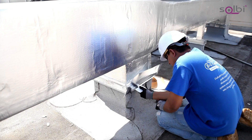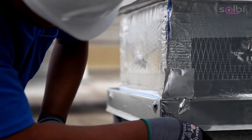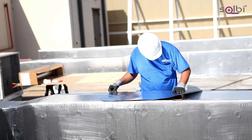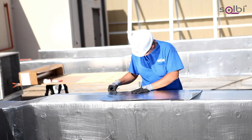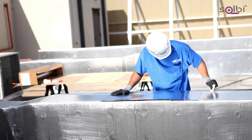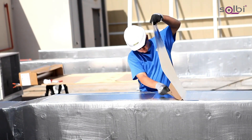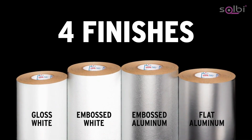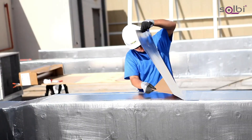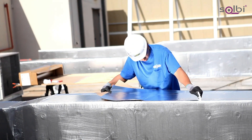The flexibility of the Ideal Shield Jacketing makes it easy to wrap in-line reducers, curb stops and legs. Ideal Shield Jacketing is a self-adhesive, all-weather, flexible protective laminate with a unique acrylic adhesive. Once installed and squeegeed in place, it becomes an outdoor durable, mold-resistant, zero-perm vapor barrier for complete moisture protection. It is available in 4 finishes: embossed aluminum, flat aluminum, gloss white, and embossed white. Building owners, engineers and contractors will all benefit from using the Ideal Shield Jacketing system.